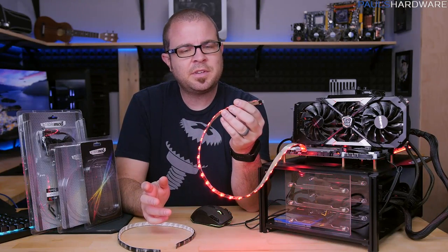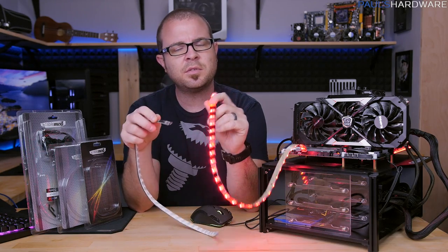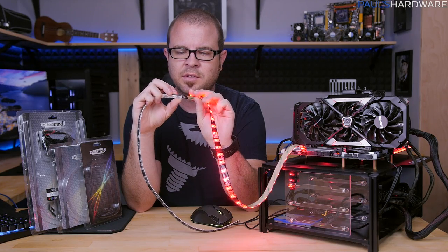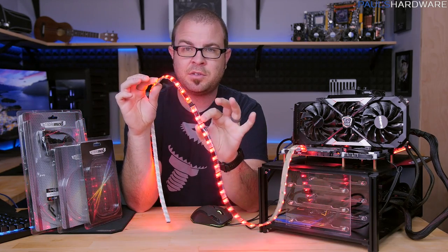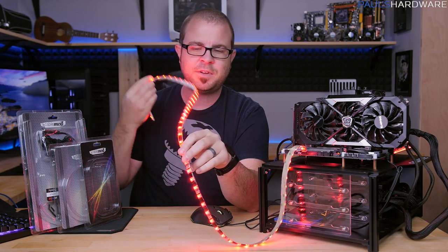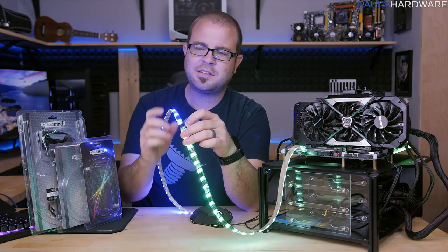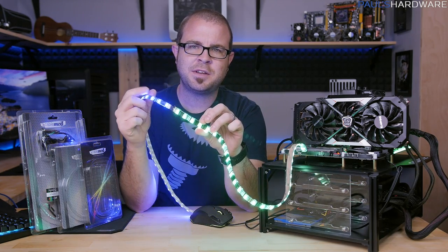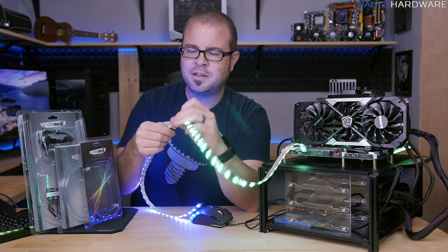You can also take a standard RGB LED strip and connect it to just the four pins on the end of this five-pin RGBW strip to extend it a little bit. Most RGB strips have a limitation on daisy chaining — the CableMod strips here are limited to three meters total, so you can't infinitely connect them. One caveat: if you have flipped values — right now it's trying to be green but this one has green and blue swapped, so it's blue — it won't always work 100%, but it's still kind of fun that you can connect both types together.